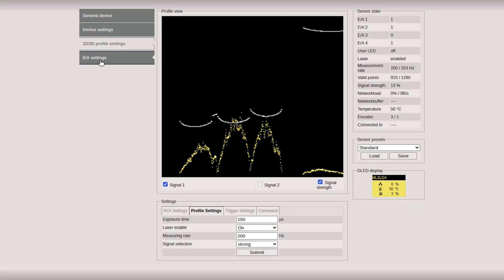This is far more sophisticated than a barcode scanner in a shop. I saw your three fingers in perfect portrayal there. So here you can see my fingers, but if it's installed on the robot and you move the robotic arm, you can stitch all the profiles together and get the 3D point cloud of a part. We scan the neighborhood of a seam, and in this way we can get the very accurate shape of the joint that we want to weld. Our system can analyze this point cloud and adapt to the deviations of the part.